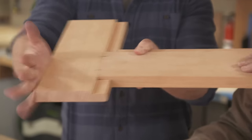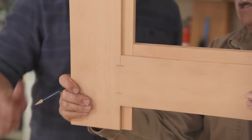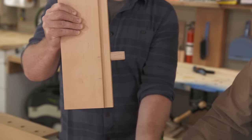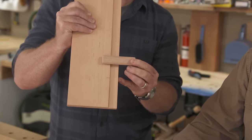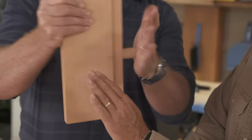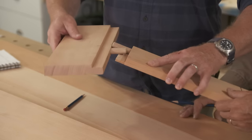Right. So now, the half lap. Over time, when that door swings on a hinge, that's not going to settle down and sag over time. Right. And again, it's sort of a nuance, but I'm not sure people understand this. These are the oversized floating tenons. So when that is actually in this, it's going to be pretty deep into the material. Exactly. And that lessens the chance of this twisting. All right. So we've got a Tommy super engineered joint right there. Upside down there, Sonny.